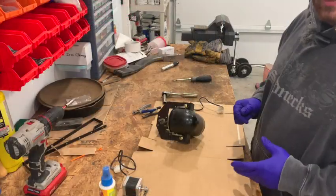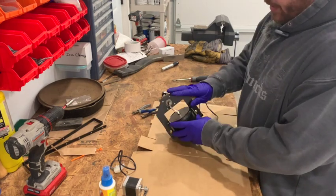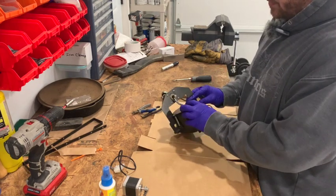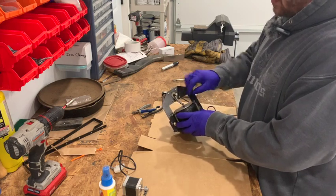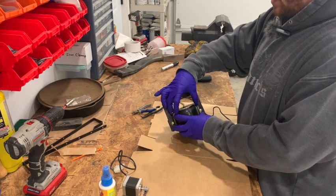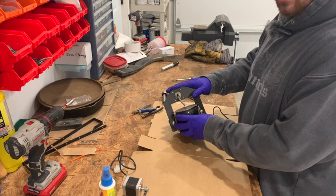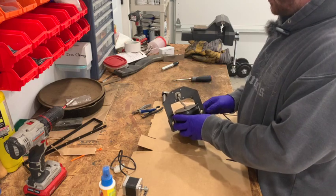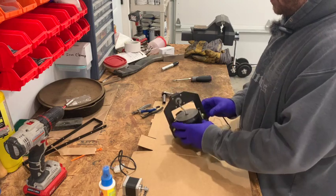So we've got it back here on the bench. I'm going to take this bracket off, and then I can pop these springs off. I'll be able to pull this plate away, and then I'll show you there's a cotter pin underneath. Take the cotter pin out, take this top plate of the damper off, then take the screws out, swap the stepper motor off, and reinstall everything. I'm going to take the opportunity to clean up whatever creosote's in there while I've got it apart.